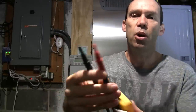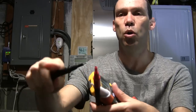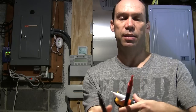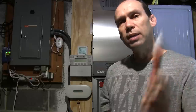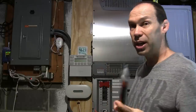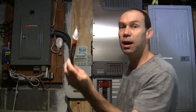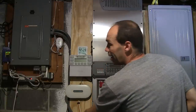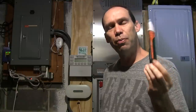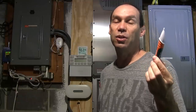If you're going to use a multimeter to check circuits, use test probes that have the bulk of the shaft covered with only the last few millimeters exposed. It's very easy to cross things over when working and create a short across the leads or within the box itself. Also, I have a non-contact voltage detector, and I never just go in assuming something isn't live. I always go and check it on a known live circuit first to confirm the tool is working, then test the circuit I want to verify is de-energized, then go back and check on the live circuit again. Your tool might not be working when you think it is, and you might end up touching a live circuit.